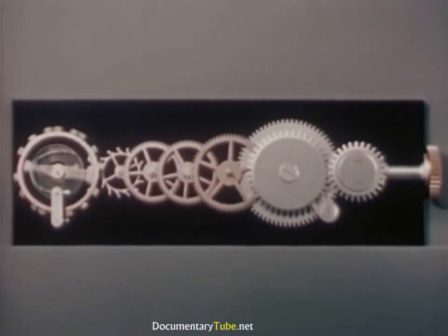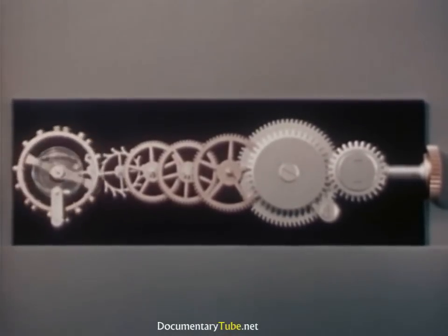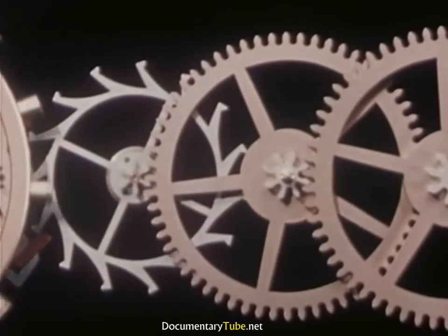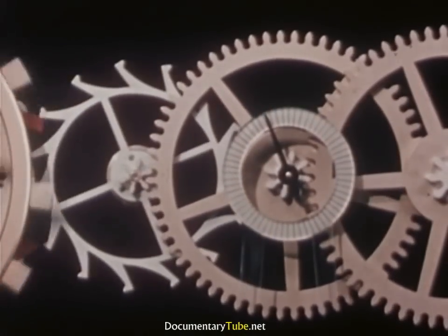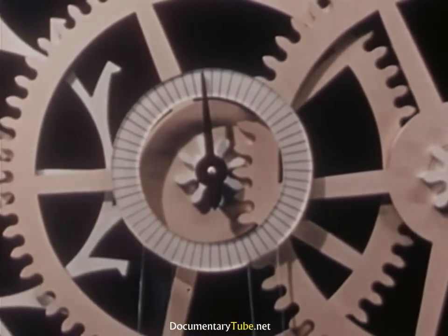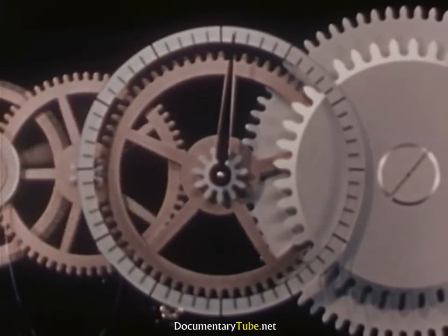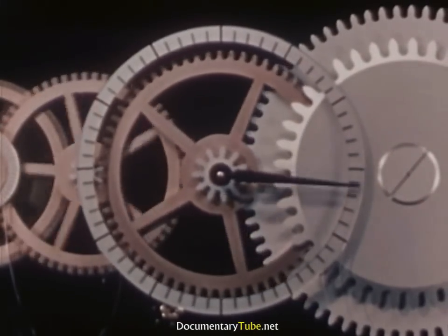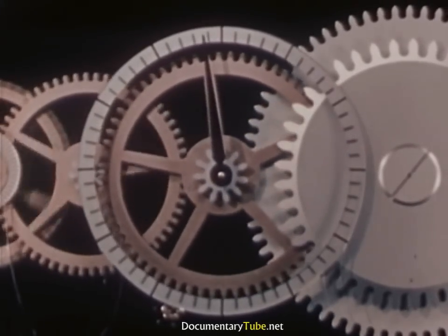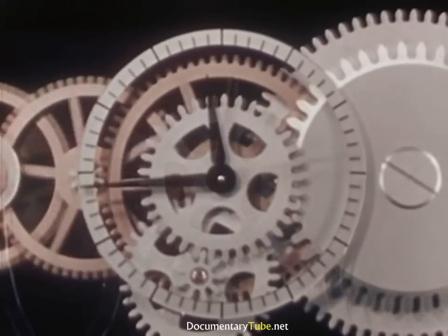All we have to do now to measure time is count the ticks. But this would be a tedious job and not very practical. Just as we needed a dial on our water clock, here too we need a method for recording the flow of power. So, to the shaft of this gear or wheel, we add an indicating hand to measure seconds. As the gear train of a watch moves far enough to make five ticks of the escapement, the second hand moves one graduation on its dial. To count the minutes, we can attach a dial and fasten a pointer to this gear wheel, which is just the right size so that it turns one complete revolution while the second hand makes 60 revolutions. And to count the hours, we can have another pointer geared just so, to move one complete revolution every 12 hours.